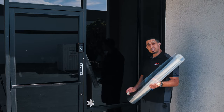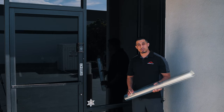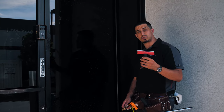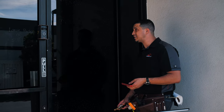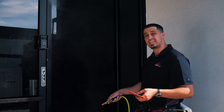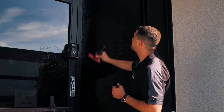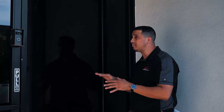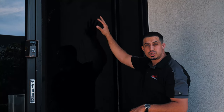Let's go ahead and get this installed and see what it looks like. Before we get started I'm going to clean the glass. I'm using a 6-inch Triumph blade — these are stainless steel blades — and it's going to remove any of the contamination on the glass. When installing anti-graffiti film we want to make sure we focus on high traffic areas that are within reach.